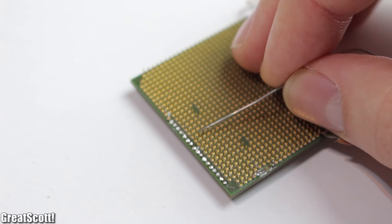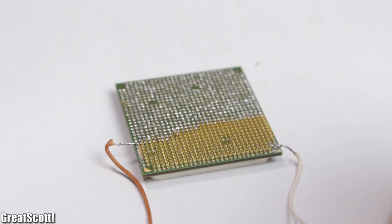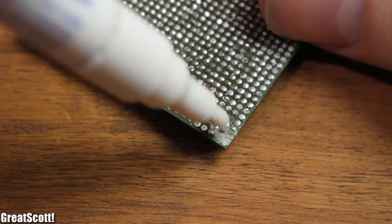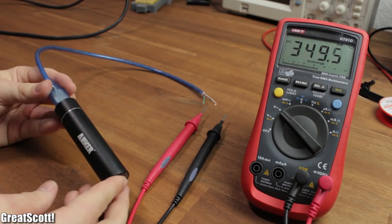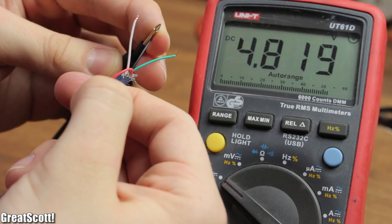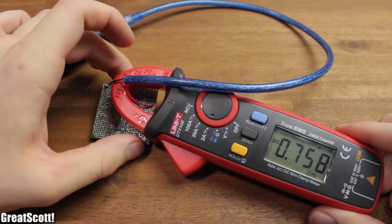It is time to finish this prototype. I used my soldering iron to remove all the pins of the CPU — I put a bit of solder on top and went through the lines with a bit of force. Those pins stick to the tip of the iron and can easily be removed. Make sure at the end that there are no solder bridges between two points. I marked my two important pins and got myself an old USB cable, cut off the old plug, and exposed the four wires inside. I connected my power source and measured the voltage on those four wires — the red and black wire carry the 5 volt power, so we can cut off the unnecessary cables and the shielding.